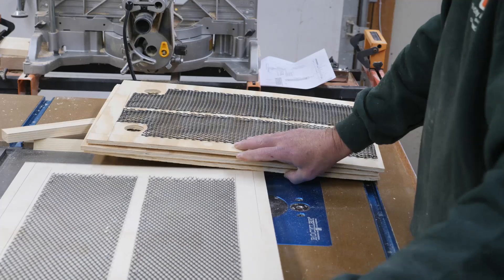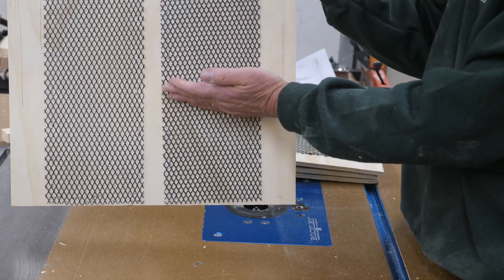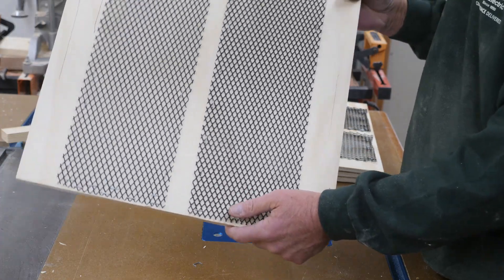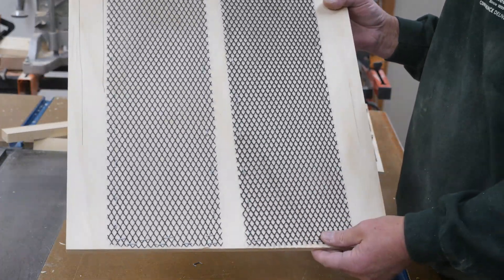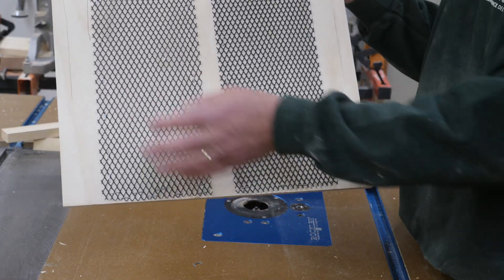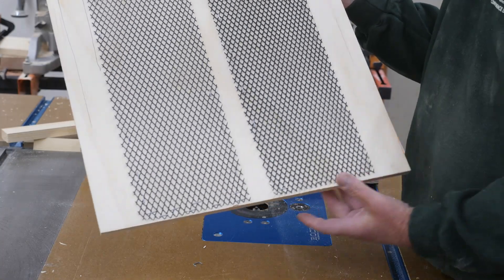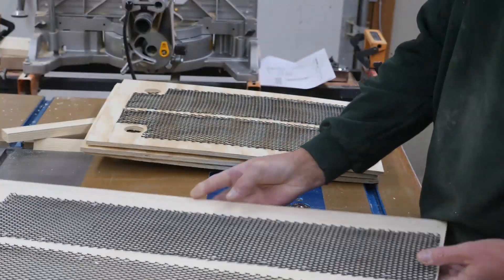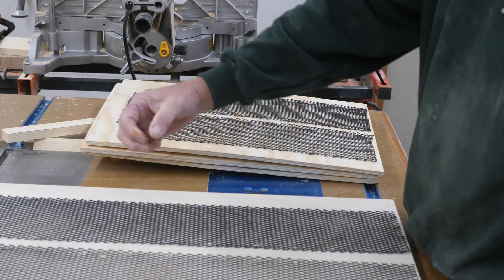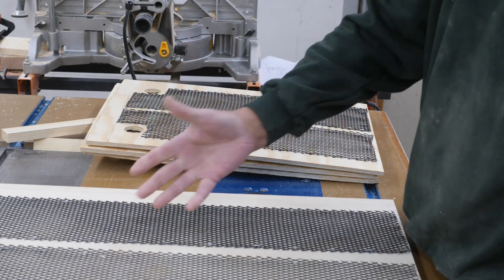Also on the backboard — this will be the part facing out — the lower part will be open. If you're going to paint with a brush or roller, you should paint the backboard before you assemble it, at least the bottom portion. I'm going to be spraying so I won't be clogging these holes, but if you're using a brush or roller, paint this lower part first. On your staples, you can use a hammer tacker if you're accurate; otherwise use a regular staple gun or electric or pneumatic stapler like I use.